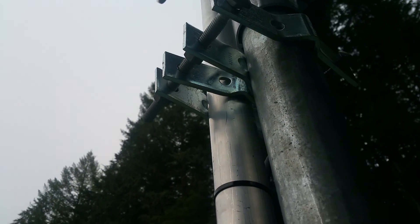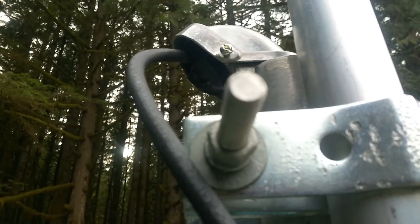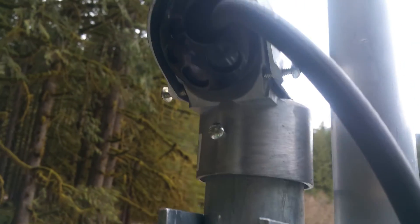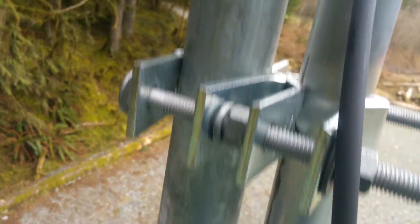I made up these clamps — I don't love it, but I have to use the other clamps for the two other antennas. The Sinclair galvanized clamp is light duty but okay. I couldn't find zinc-plated hex bolts — I went to three stores. The waterproof joint is inside: two connectors, the antenna's original N-male and an N-female connector, right inside. Sometimes I install it against the mast, but in this case I squeezed it inside below the service cap.